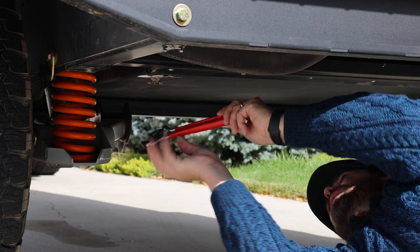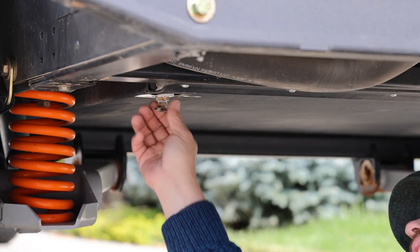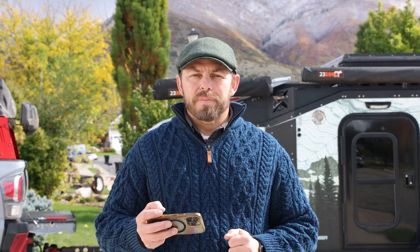So now we're ready to move on to step 9. And in step 9, it's very important that we set our compressor to 45 psi. We don't want to overpressurize the system and risk potentially blowing out some portion of that water system.